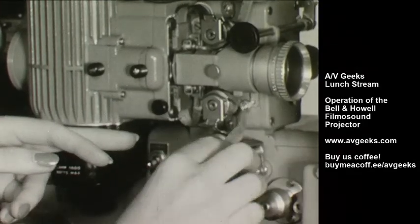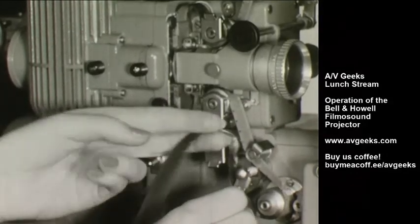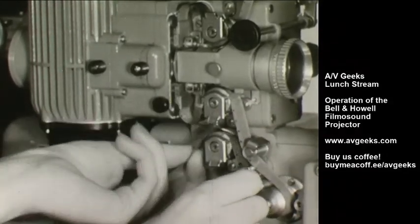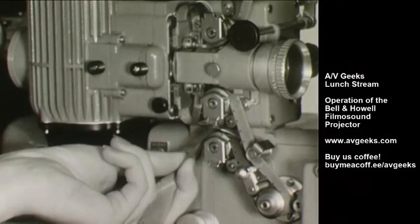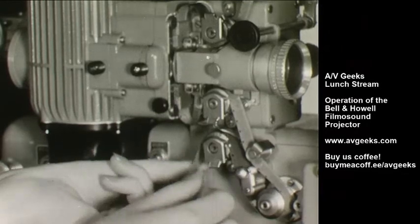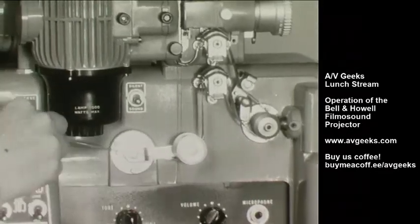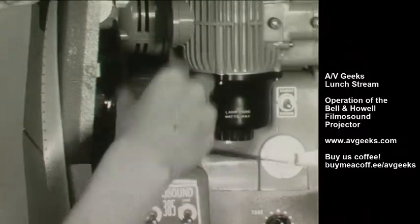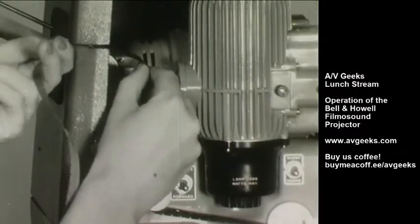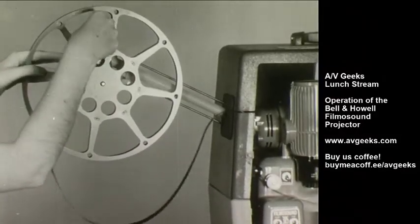Lock the film. Next, pass the film under the upper stabilizer roller, around and under the sound drum, and under the lower stabilizer roller. The film is locked in the sound sprocket so that it fits snugly around the sound drum. Pass the film under the snubber roller, under the rear guide roller, and through the rear slot. Then, the end of the film should be passed under and around the bottom of the take-up reel.